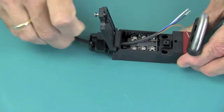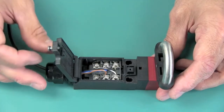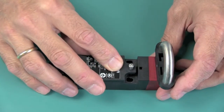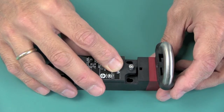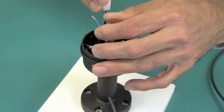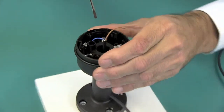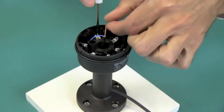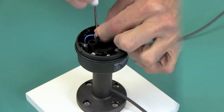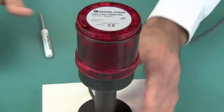It is no problem if your application requires a different safety device. Any dry contact safety device, like this door switch, can be used. The second pigtail cable contains the non-safe output leads. Brown is plus 24 volt DC and blue is the signal common. I will use this stack light with a red LED cluster to annunciate when the e-stop is pressed in.